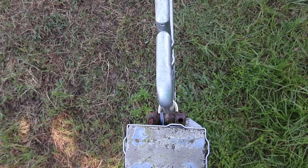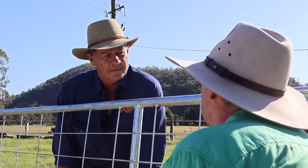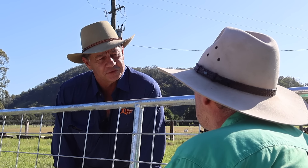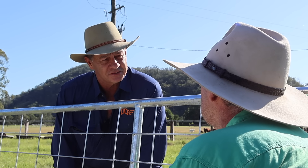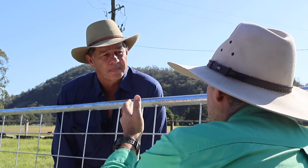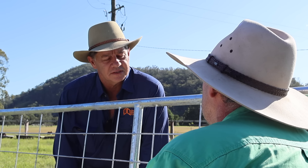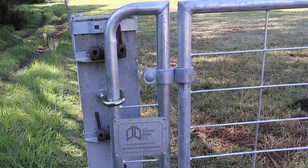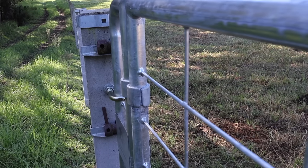You put other modifications into this gate to improve its performance. Improvement number one was notching your welds rather than flattening the pipe. There's more surface area when you pipe-notch something and weld it, which means greater strength. So rather than squashing the pipe and creating a point of weakness, you've kept the pipe completely round and notched it to the pipe at the joint. The next thing was moving the mesh from the outside of the pipe to the inside to protect it from the cattle, so the mesh mat is less likely to be broken off.